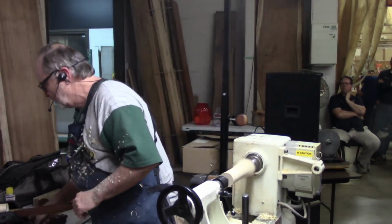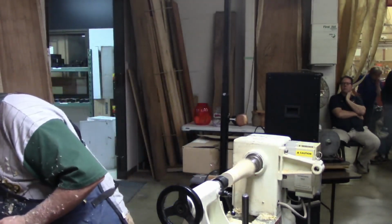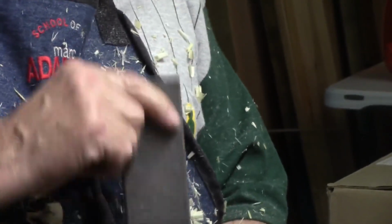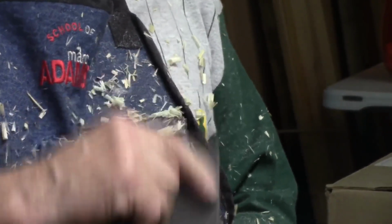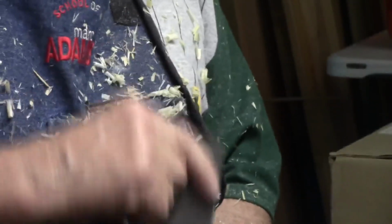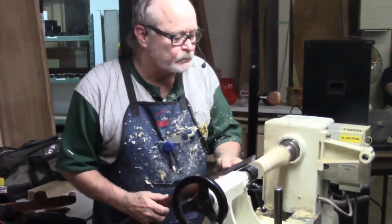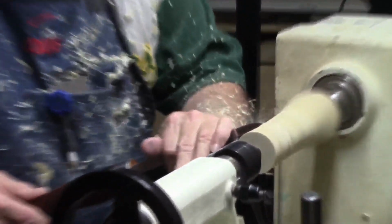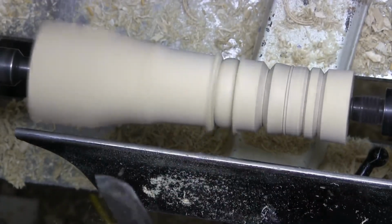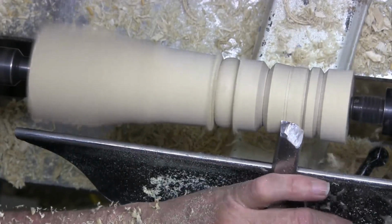So here's, and I really did land my little guy on the floor. Ooh, did I ever. Let's see if we can fix him without grinding him. This is probably one of the hardest cuts in wood turning, and people come to it prematurely. You want to come to this cut last with a skew, and you want to go to a smaller skew. So just in 2 passes, you can roll a bead with a skew. Now, that's a very hard way to do a bead. So here's how I advocate you learn it. This is a slower way of doing it.